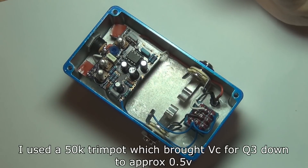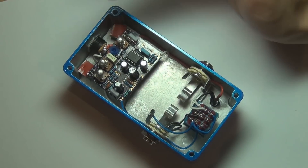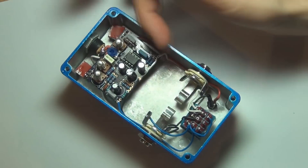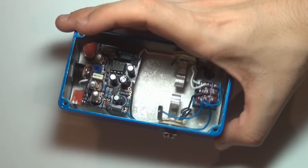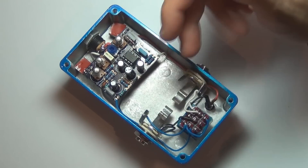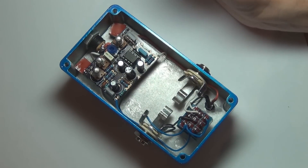So the trim pot is optional — if you want to experiment, go right ahead. I did it anyway and I'm glad I did because it was a bit of fun starving it and getting some pretty wacky sounds out of it. One of the stuff-ups with this first prototype version of the board was I actually put those two pots in around the wrong way — they should be flipped 180 degrees so they're pointing downwards. That's why the top of the pedal is all bunched up. I wanted to demonstrate that even without a battery you can easily fit one in — you'd put it down the bottom, and there's plenty of room for a battery if you want one.